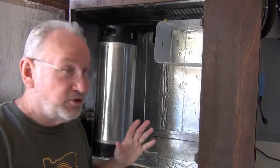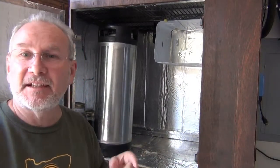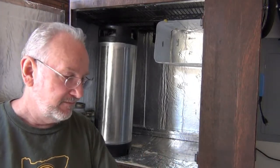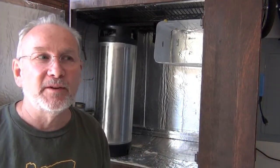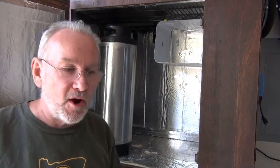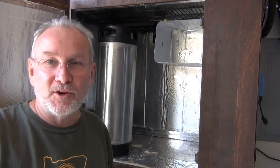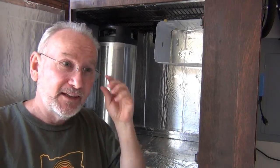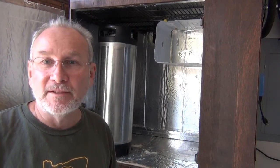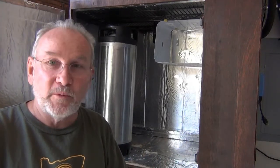As you can see, I totally overdid it — that was fully my intention. Hoping to get a little bit actually inside the crack and then seal all around the outside. It can hold pretty high pressure, and hopefully with having that much on there it'll do the job. The next step is going to be really interesting because a buddy of mine is going to come over and install a valve so it can be pressurized again, and we'll do a leak test. Then he'll go ahead and put the inert gases — Freon or whatever it is — back in.